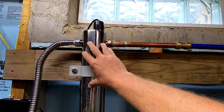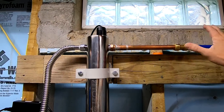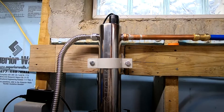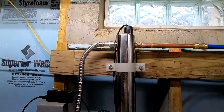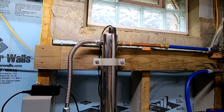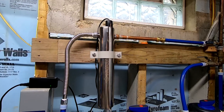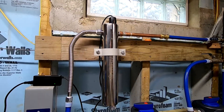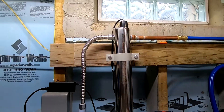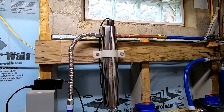Also, these can heat up when water is not being used. Again, that's not really a consideration because PEX pipe could handle that. So PVC, CPVC even, PEX — all of these types of plumbing are susceptible to UV damage. This is a big thing and a big error that I see in almost every video on YouTube and every post that I found on the internet: people are using their plastic pipe to connect to their UV filter. So if you're going to do this yourself, that's the first thing to not do.